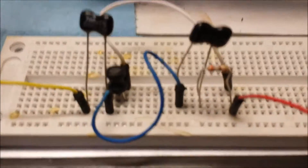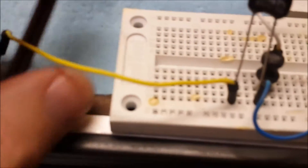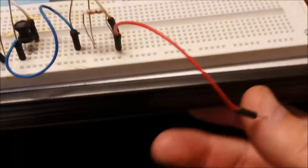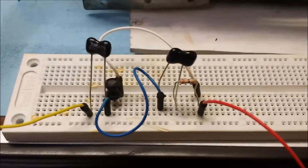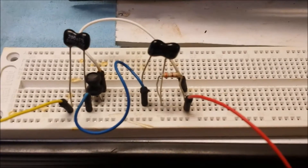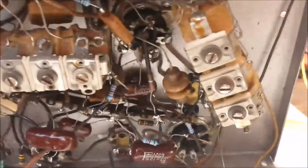When we did it, we connected the signal generator to one end, and the other end went to the antenna. I know on some of the radio boards there's a lot of discussion on whether this is necessary or not — probably isn't — but I went ahead and did that. Following the alignment instructions in the manual, you inject a signal and adjust those antenna trimmer caps.